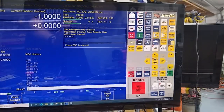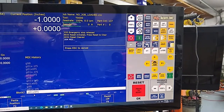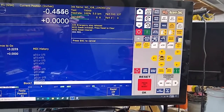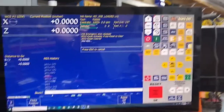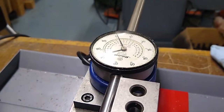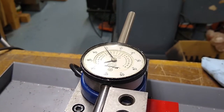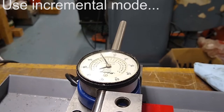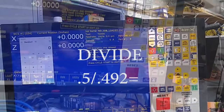I'm going to send it back: G01 X0 F5. We'll take the lash out of it — go in the positive direction a few thou. Now we're going to go back in the negative direction until the indicator is back to zero. There, it's back to zero. Now we've got to do some math.